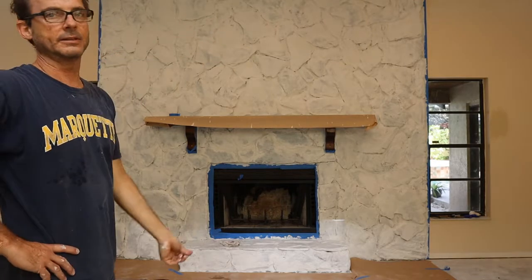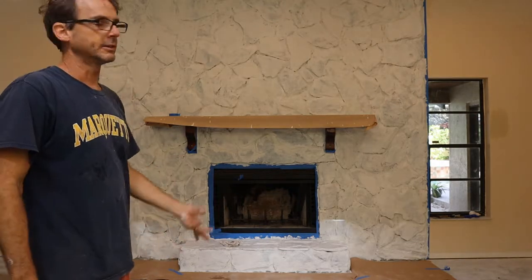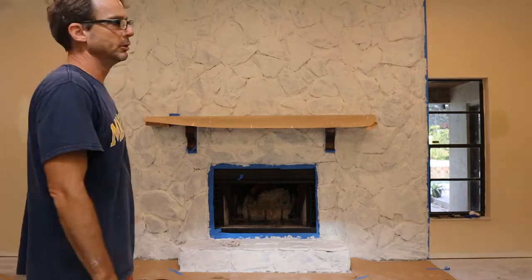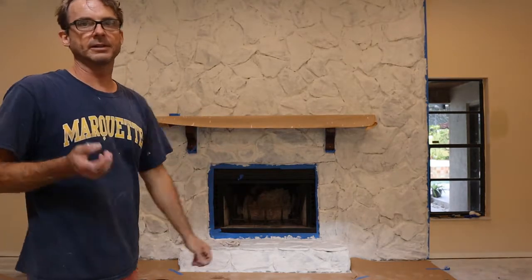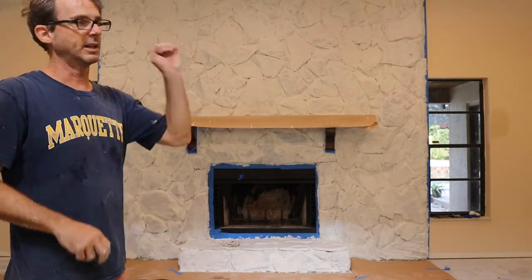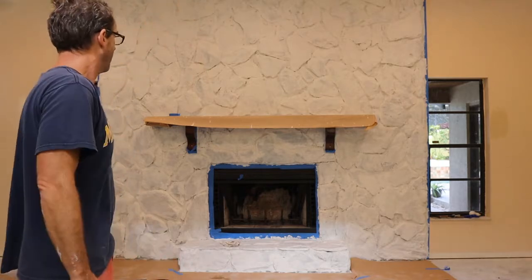Then I'll use a brush, and the whole while I'm going to be really looking for drips. In about an hour I'm going to find any drips I can and just sand those off. You have to use so much primer to prime this — I went through three big brushes and two little ones. The only way is to really fill it up and just mush it everywhere.